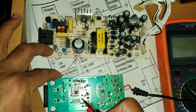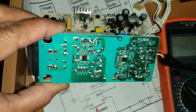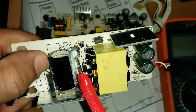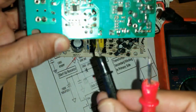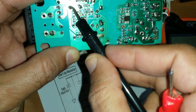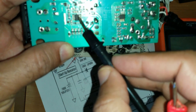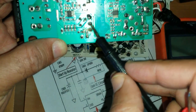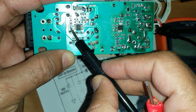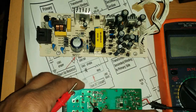After the diodes, check this small capacitor — it is connected from the main supply here, going through to here. Remove and check the capacitor with your meter set to capacitor mode. This capacitor is connected to the main supply, and from the other side it goes in series through two resistors to this IC. This IC regulates the switching of the MOSFET. If there is no supply at the output of these resistors, then there is no soft-start power, and the system will not produce output voltage.